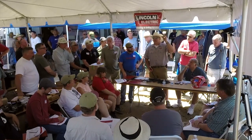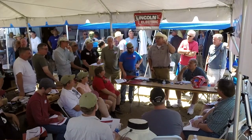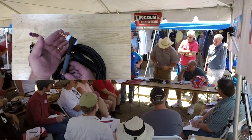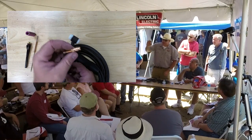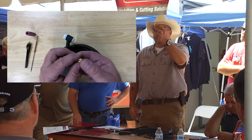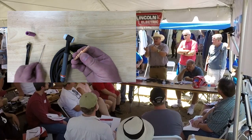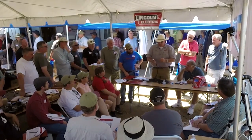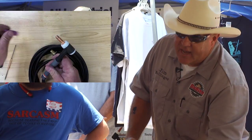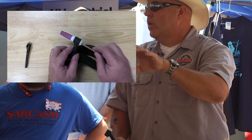There are times when you have a WPS — a weld procedure sheet — that tells you the exact size you need, but for most of us welding at home or in our shops, we don't need to know that. Just know that the opening gets smaller and bigger — if you need to get into a tight area, a big giant cup won't fit. This is a collet body, just like a collet closer. The collet goes in the back of the collet body, and when you tighten the back cap down, just like any other collet, it shoves the nose in and tightens down to hold your tungsten. On the collet body, there's a bunch of holes — that's where the argon gas flows out. It swirls around inside the cup and comes out, keeping your tungsten and your weld protected from the atmosphere.